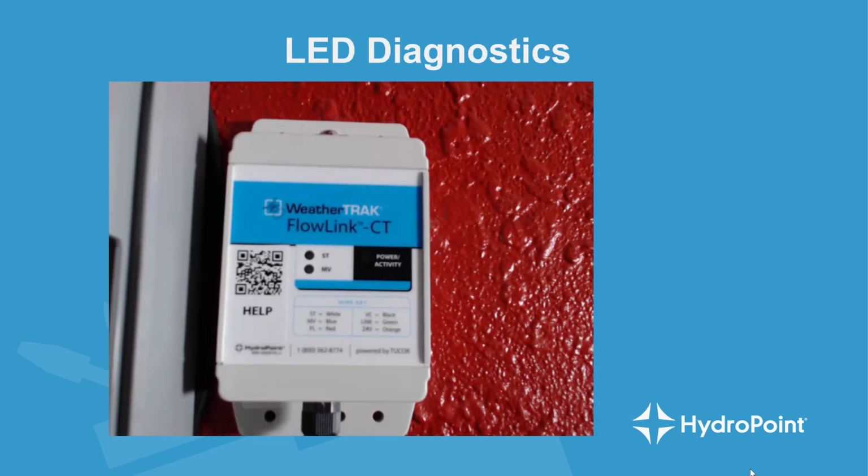And now that you've completed the wiring installation, you can start to use one of the key features of the FlowLink, the LED diagnostics. As you can see on the CT, before you add power, none of the LED diagnostics are illuminated. But as soon as you plug in the orange wire, you see the power and activity LED illuminate on the CT. And this is a key piece of troubleshooting information.